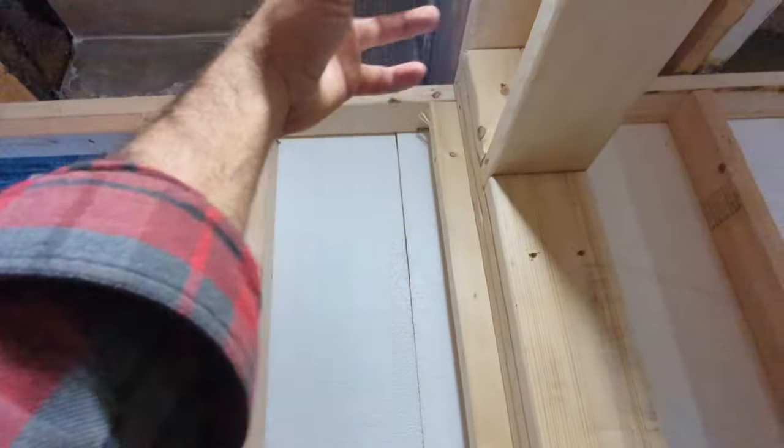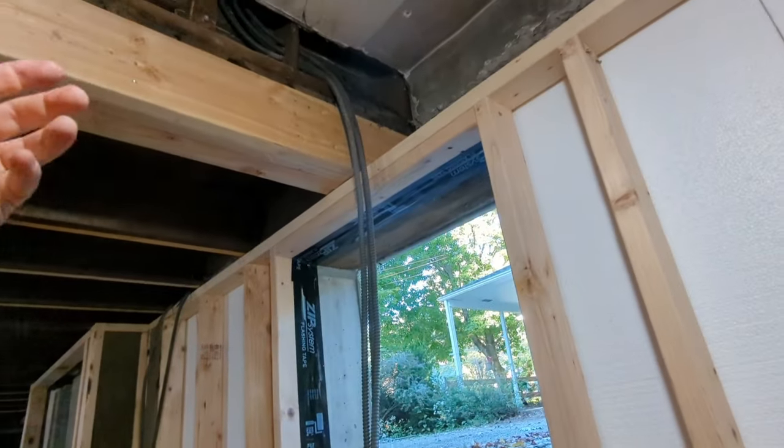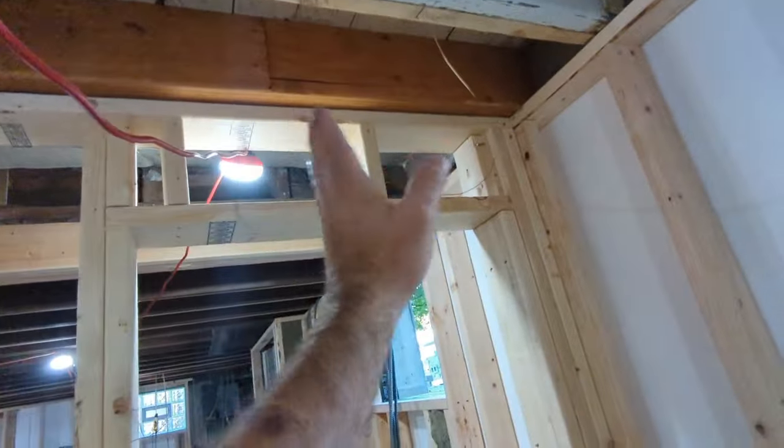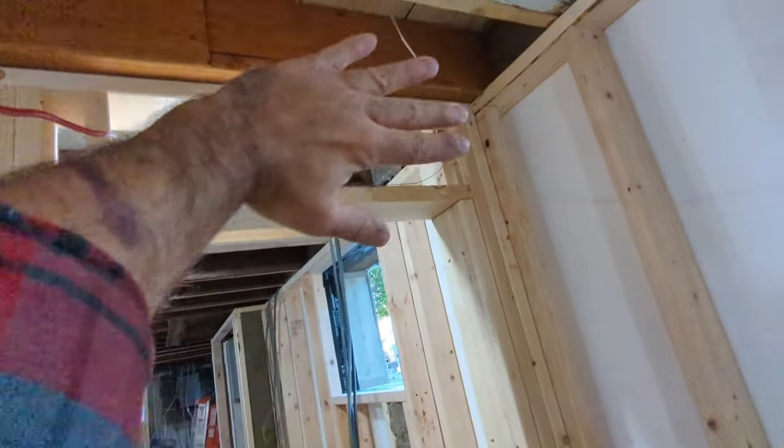And so we've got a big area to jump, and if we were to make this a raceway, then we're going to turn and go across the face of the beam, then come through there behind the plane of this, and then come into this area here. This is why I say half a dozen, because even though we have the depth there to do two courses, we don't have the ability to lay 12 lines along this beam.